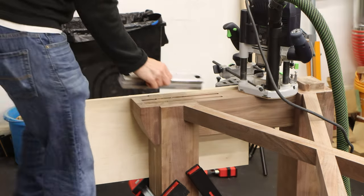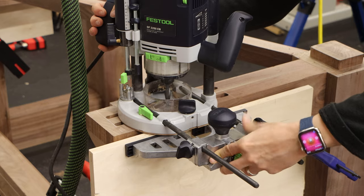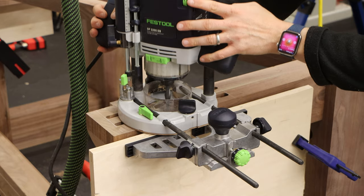With the extension installed, I can install the linear rails. Spacing is really important since the carriages are already installed on the sliding top, so I cut a slightly oversized recess for the linear rail to sit in — which is fine as long as the linear rail is exactly 9/16th of an inch inset. Where they're bolted in is extremely important: the rails must be parallel to each other and perpendicular to the fixed top. They must also align with the tenons for the vise and the ends of the bench must be in line — so it's very important to measure 72 times. After applying chamfer details and finish, I tap the holes and bolt in the linear rails.